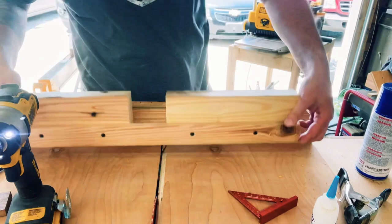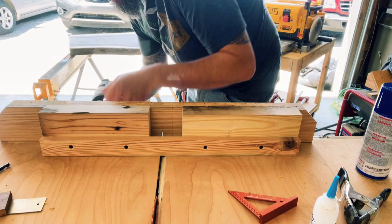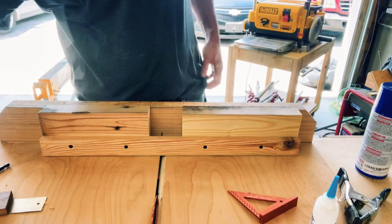Now I'm just going to center the jig with the blade, but keep in mind that you will be cutting at an angle, so I have a little bit of offset there. I'm putting a couple of screws in the back to hold this jig in place — actually using the same screw holes I use for my box joint jig.